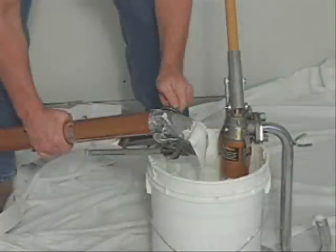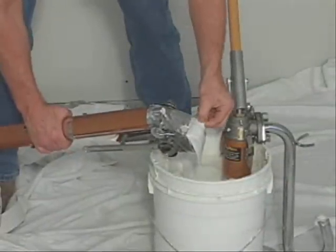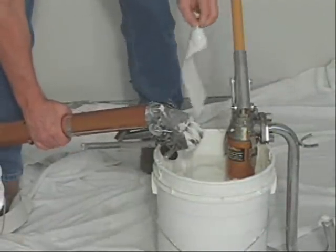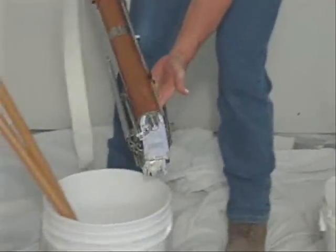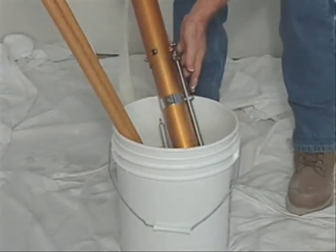When putting the taper aside for a short time, put it in the gooseneck. For longer periods, such as lunchtime, close the gate valve, tear off the first foot or so of joint tape, and put the taper head down in a bucket of water.